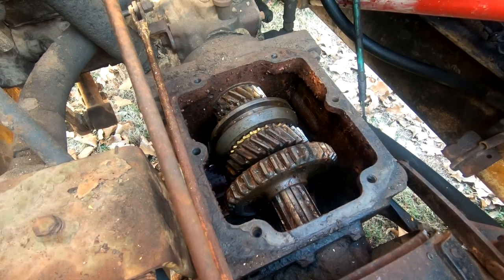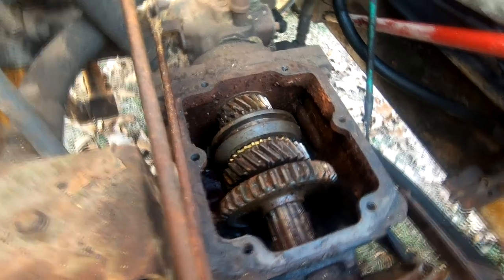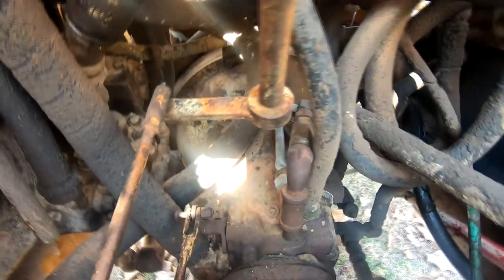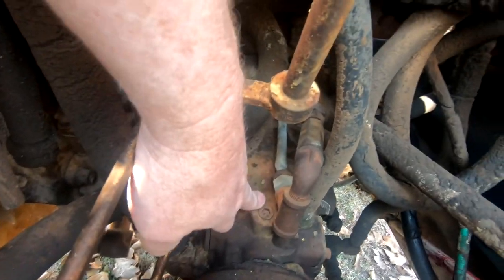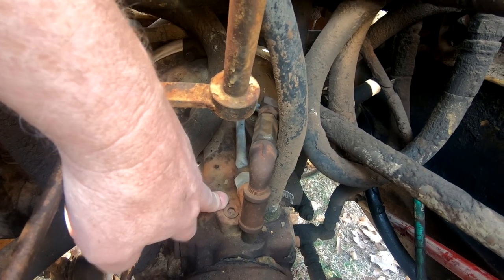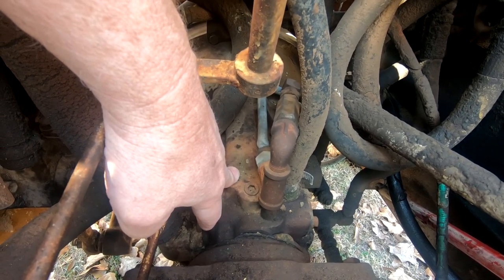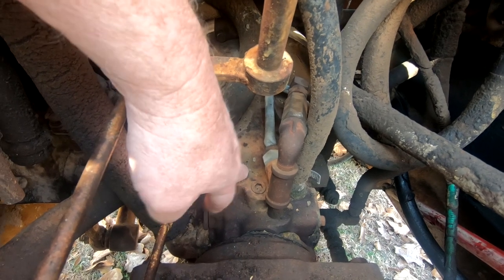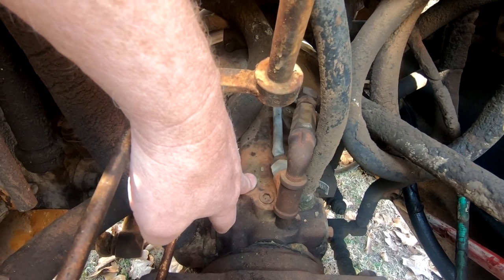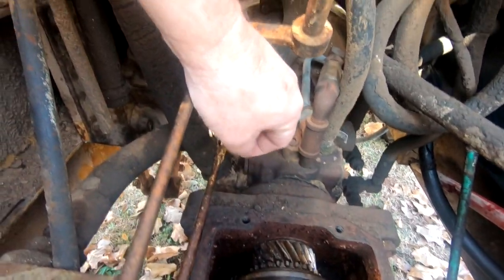It's not nearly as bad as it was. That doesn't mean it's a good transmission - we still need to pull it and check it out. But I'm more interested in what's going on back here. This section right here of the drivetrain is what we call the reverser, or shuttle. What it does is allow you to remain in gear and just shift back and forth between forward and reverse. That's helpful when you're doing a lot of earthmoving, moving back and forth without always shifting. You just have a little gear shift near the steering column where you shift it back and forth, and that makes the job easier.